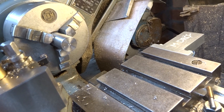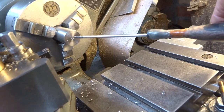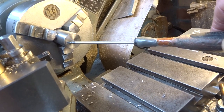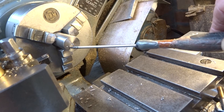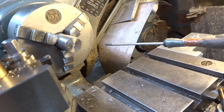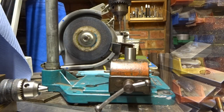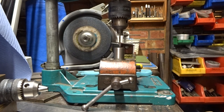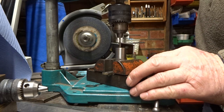I'm going to make the two cranks for the crankshaft from a bit of 3/4 inch stainless steel. We're going to centre-drill and tap that 5BA, and then using the lathe I've marked out a quarter of an inch from the centre and put a dot punch mark there, so the total crank throw will be half an inch, which I think will suit the cylinders I've made. Back in the setup to tap the hole for the quarter-inch throw.